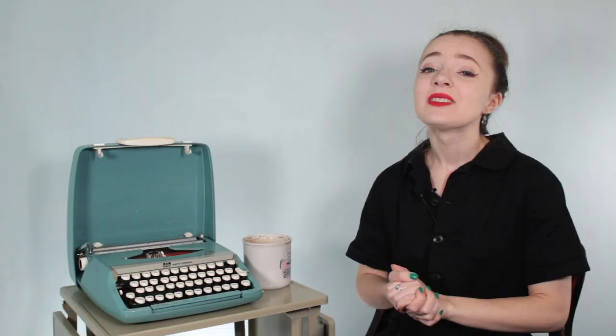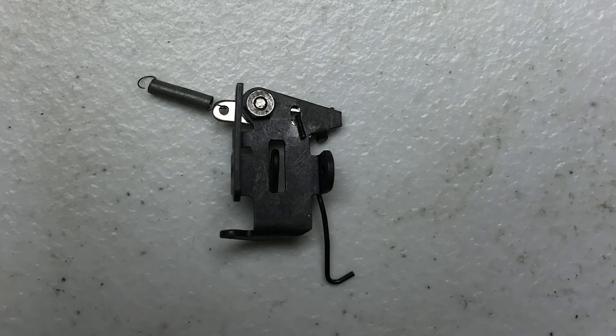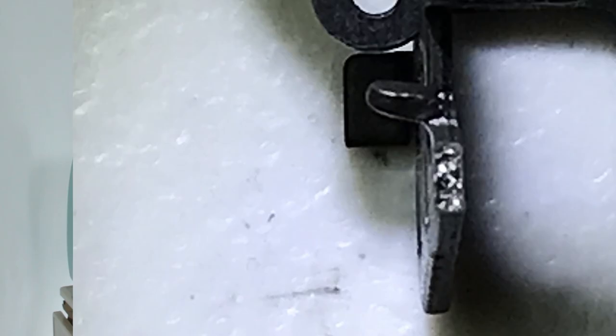The rigid dog is a fixed hook attached to the plate that stops each arm of the star wheel every single space — and mine was snapped off. The tricky part: it had snapped so cleanly that it looked machined that way on purpose, completely flat with a straight edge. Nobody in the maintenance group — not even Lucas from Typewriter of Chicago — could identify it as broken. It was my dad who suspected it. When we removed the piece and looked at the side, we could see exposed silver edges confirming the hook had snapped off.